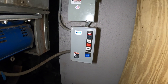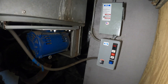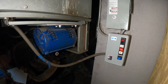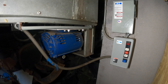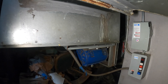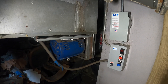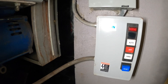That's pretty much how to change heaters for your overload relay side of your motor contactor. This is so much better — what a difference. I'm really glad we were able to revive this unit. The amount of racket it used to cause was unbelievable, with the bearings being that dry. They were already thinking it was time to replace the unit, but like this we were able to give it some life. If anyone found this video interesting or helpful, please drop a like, comment, and subscribe — I come out with new videos every week. Catch you all next time!